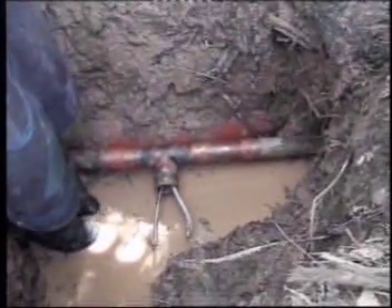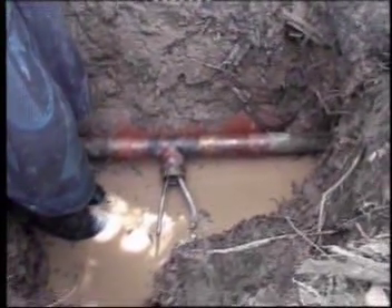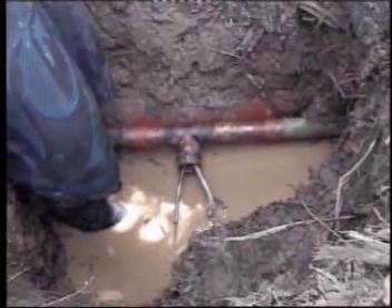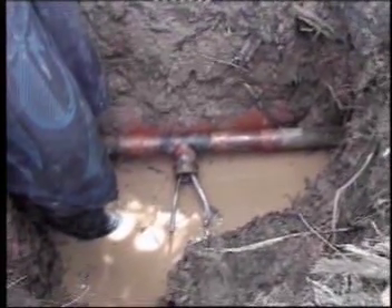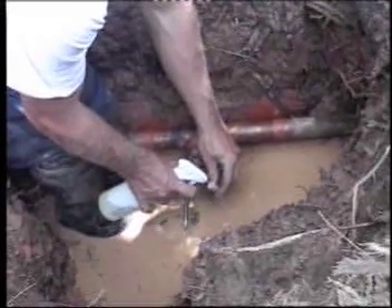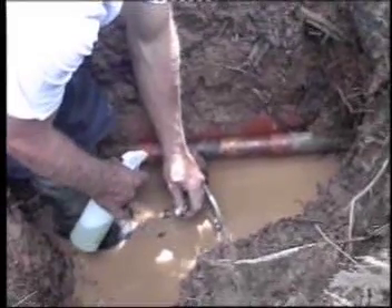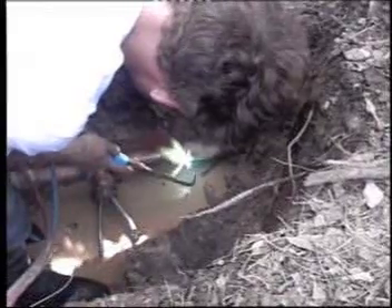Both bladders are now fully inflated in the line and we will now leave it for a few moments for the remaining water to ooze out. We can then commence our normal oxy-acetylene welding on both couplings. We also advise testing for any leaks on the end of the hose with some soapy water, just for reassurance that the bladders won't lose air while in the line.